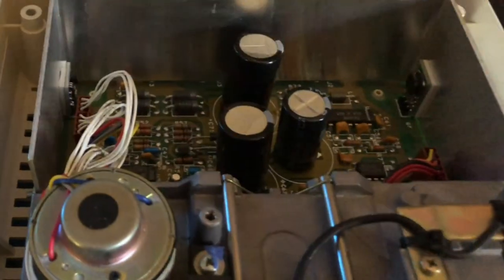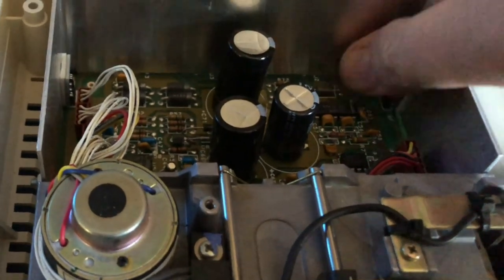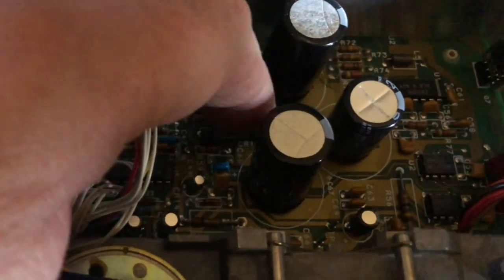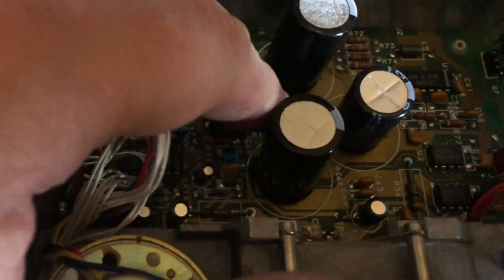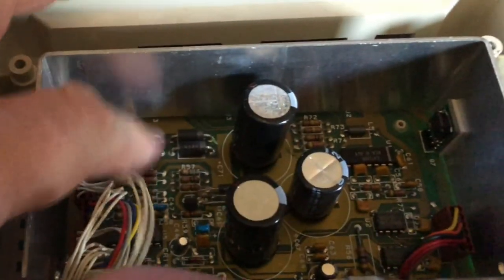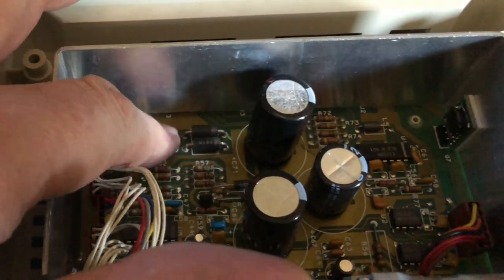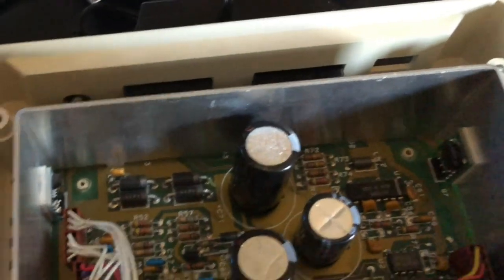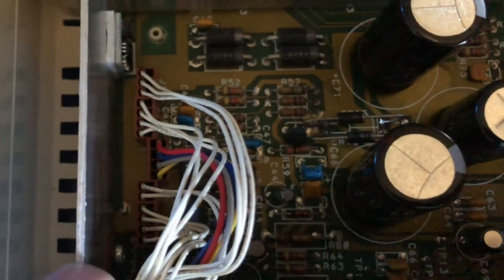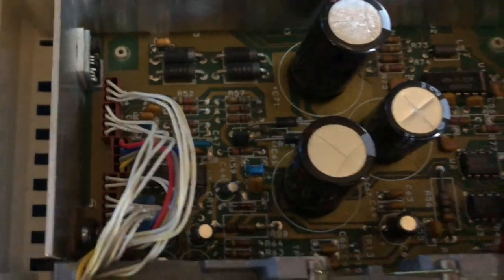No. I can definitely feel heat rising up out. Is it coming off the diodes down in here? Again, no, they're not particularly warm. I mean, I can touch them. How about the diode bridge here? Again, a tad bit warm. So why can I feel a bit of heat over here? It must be coming off this transistor down in here, that TIP110, I think it is.